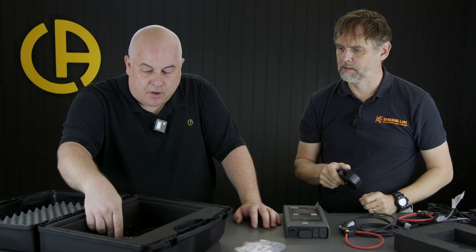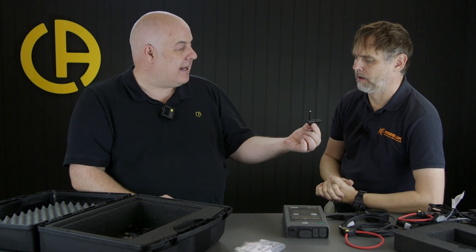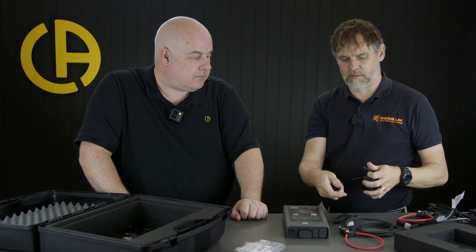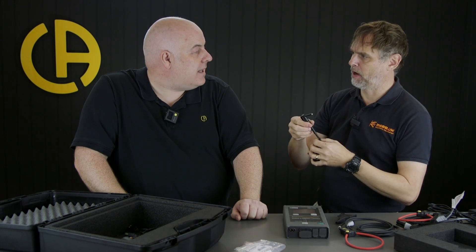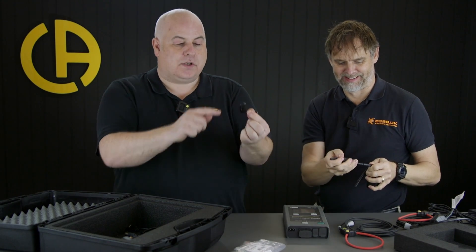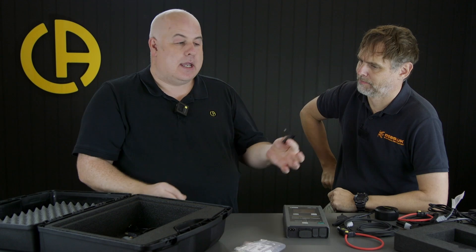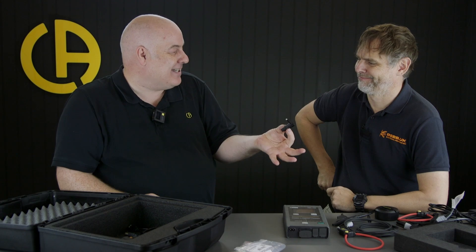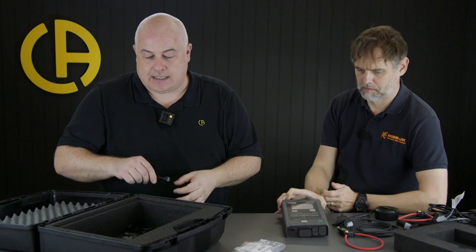So we've obviously got four of those in there. Another thing we've included, which can help sometimes with making connections, is these little magnetic probes. They are great. I have used these with my PEL 51 when you're at a distribution board - you can stick that on the end, it's got a little magnet and you can pop that directly onto the output of your RCBO or your MCB. They've also got holes through here - sometimes people like to put a cable tie through to secure them in position as well. They're just another option for connections, and we've actually had people using these with their MFTs and other testers as well because they are convenient - you just pop them on and they magnet into place.